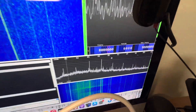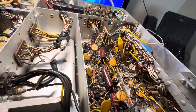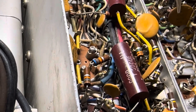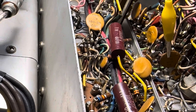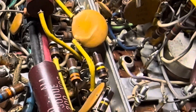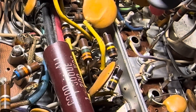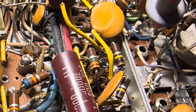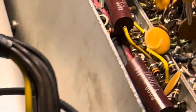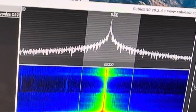I find that the 8 MHz oscillator is funky. If I simply measure the plate coil voltage on this little guy, it'll kick on the oscillator. I'm going to try and tweak the plate tank circuit here and see if that'll make it work. There's the blue wire going to the tube — if I hit this with some reactance from my meter, you'll see it pop on and then fall off. So it's got some issues — there's my 8 MHz and it falls off.